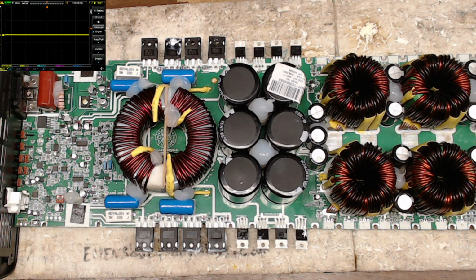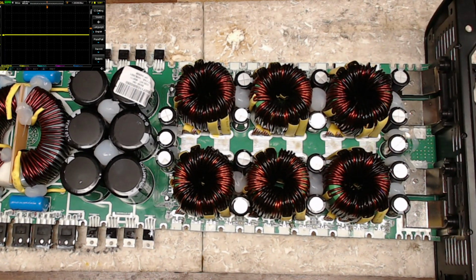I do thank you guys for watching. I just wanted to go over a power supply repair of a Taramps board that I normally don't do. It's usually the output section that has failed, but this is the power supply section. Again, I don't have an affirmative or confirmed reason why it would fail like that. I don't see any signs of reverse polarity. Could be an overload, but usually on an overload I'll see something on the output section. Again, this could be just failed drive ICs.